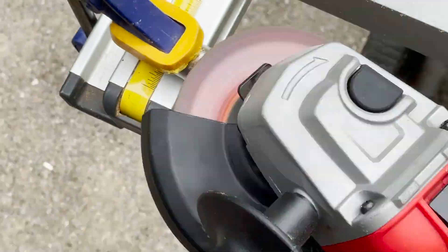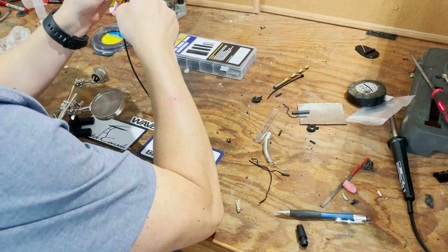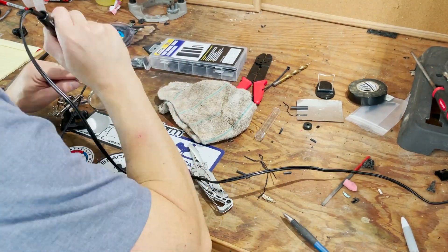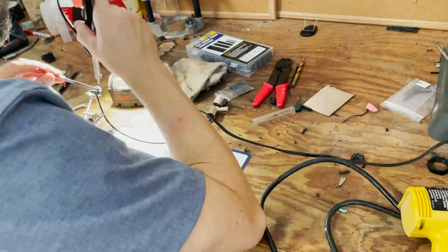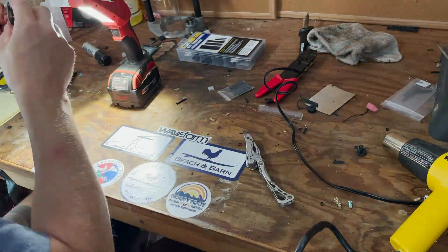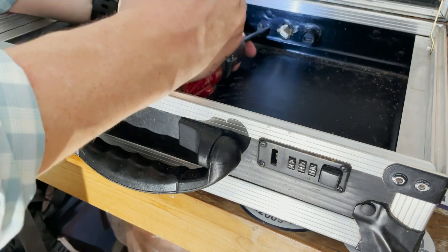As I started the electronics part of this project, this little right-angle XLR adapter that's going to plug into the Audient ID4 in the back was probably the biggest challenge of the project. I'm grinding out the back of the housing because the ID4 pushes all the way to the back of the briefcase, and this right-angle XLR connector sticks out so far that it pushes the Audient ID4 into the back of the Novation Launch Key Mini. I eventually ended up losing the housing altogether and just soldered my wire and cable directly to the XLR hots and ground. Ultimately I had to solder about five two-sided connections on this project.